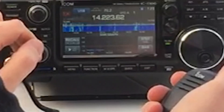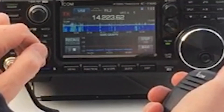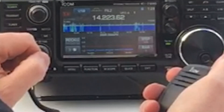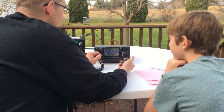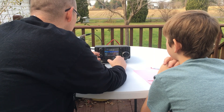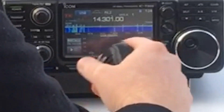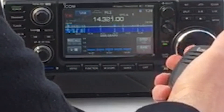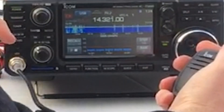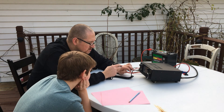Let's go ahead and try it. Pretty good — really good. We're at less than 1.25 on the SWR, so we're golden right here. Let me just try up higher one more spot. A little bit higher, closer to 1.25, but still perfectly fine. 14.267.